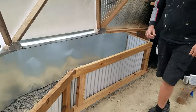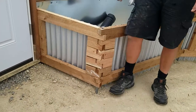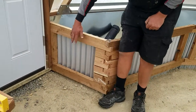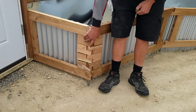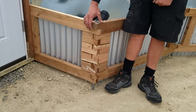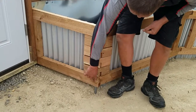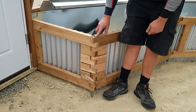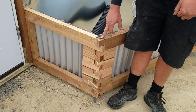Once we put those in and added a larger washer on each of those three-quarter-inch stub-up pieces of EMT, we started cutting all the cedar rails — a bottom rail, a top rail, some corners to connect into the existing structure, and then this interlocking arrangement at the sharp corners to give us support for the top rail. We did this as an artistic look — each one is notched, with the opposite notch on the adjacent piece, continuing the pattern all the way up, then drilling a three-quarter-inch hole through the center of each notch so it sleeves over the EMT tubing.